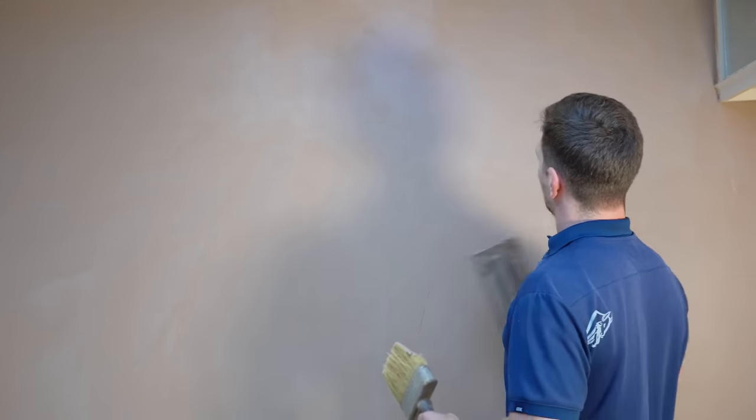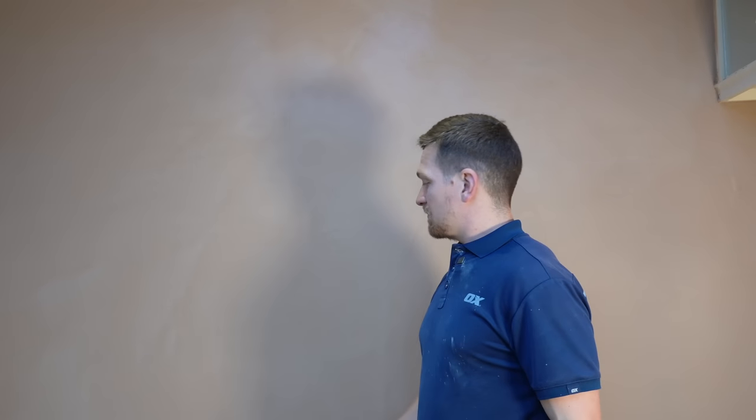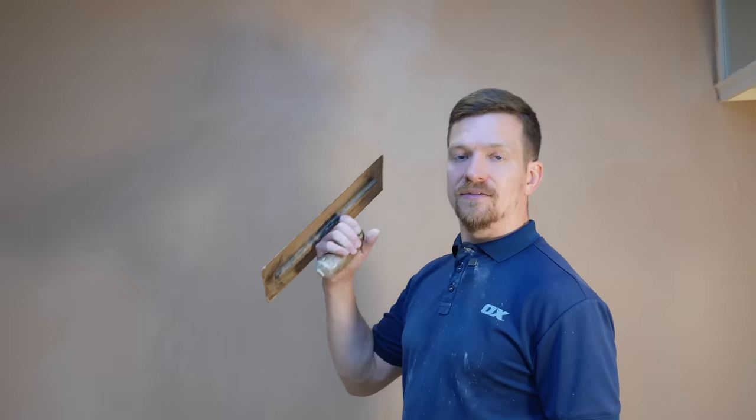When this dries you're just left with a texture that's all the same — all the color looks the same and it is a truly lovely finish. I like my plaster to look as good as possible for the customer — it gets me more work and the overall finish is better. Everything after this point is the same — we're going to flatten using the trowel using the exact same process. I've probably got two more flattens after this, then I'm going to finish with the Plaziflex.